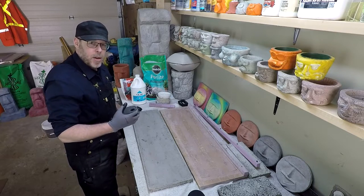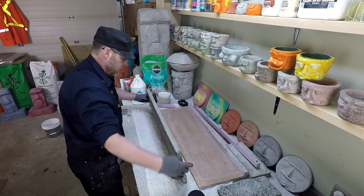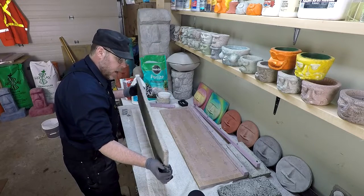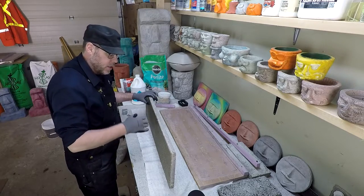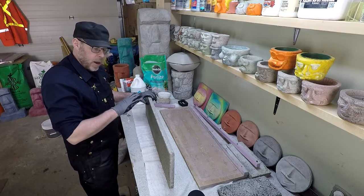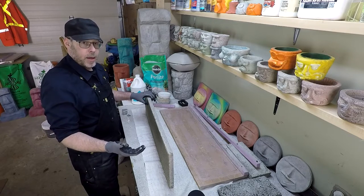I can really smell the PVA. It's got a really strong white glue smell. Definitely lightweight, like lighter weight. I can see the fibers in it as well, but I can also see that it's holding some hydration. It still has some time to cure here before it reaches full strength. So I'm going to go ahead and put this into storage for a little while and let it set up fully to full strength before we ultimately break it in a strength test.